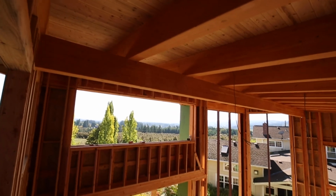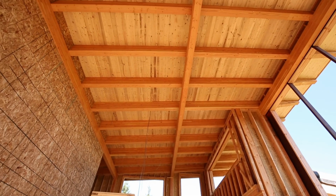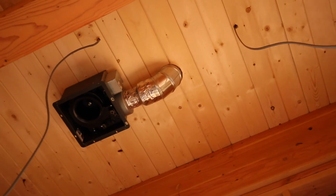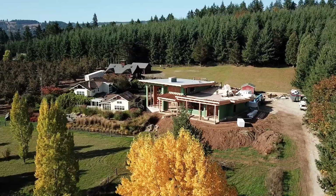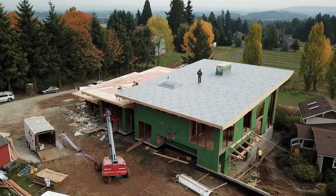At the rough stage, I bring my tradesmen in and I make them get everything out that's going out the roof before I dry it in, especially with this roof being a low slope and having a 1/12 pitch. Once you've got everything installed, get your roof on as quick as possible to dry that thing in, because any bit of moisture that leaks down, you just wait longer for your dry out. You get more rust or any buildup from a nail that may not be hot dip galvanized or a piece of hardware, and it's just more prep for the painter. So know your electrical, know your venting, and get that thing buttoned up.